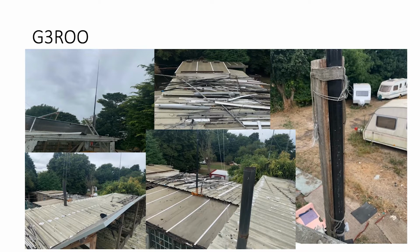I can detect some panel noise, but it's very, very slight. And if it was causing any problem, I could easily turn the inverter off and just go on the air. But it is so slight. It tends to be like any switch mode power supply noise, a little burble. I would say it's between S1 and S2, and they're on discrete frequencies, so you can avoid them with a bit of luck.